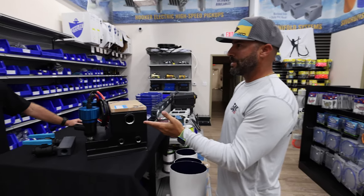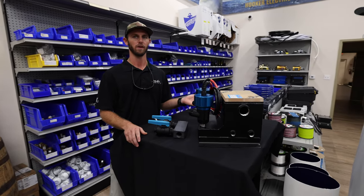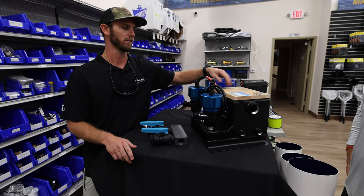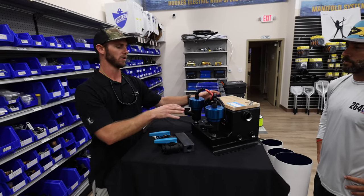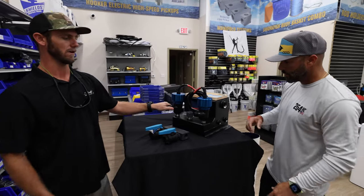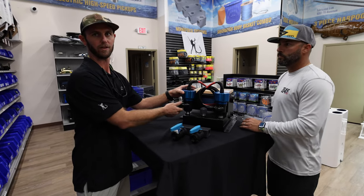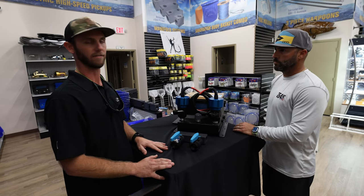The pumps are outside the box on the sea chest for easy customer access to serviceability. A lot of sea chests on the market have submersible pumps on the inside, and when that pump goes down, you have to take all the bolts off the lid, cut the wiring, and redo all the plumbing inside. These are nice because it's a cartridge pump — the base stays on, you take the blue top off the black housing and spin it out just like any cartridge pump. You can send it to us, we'll service it up and get it back to you the next day.